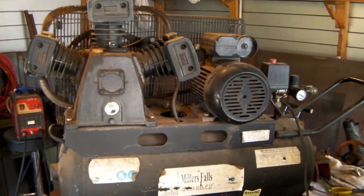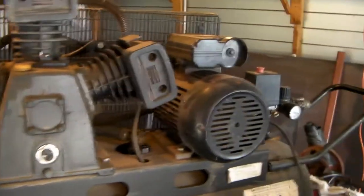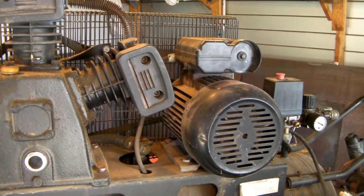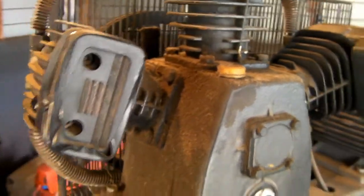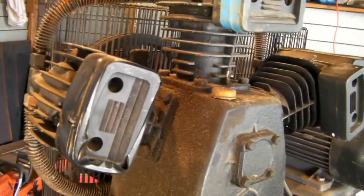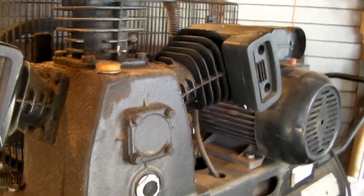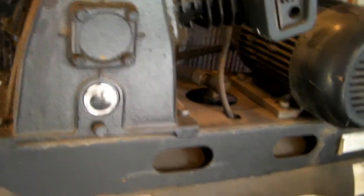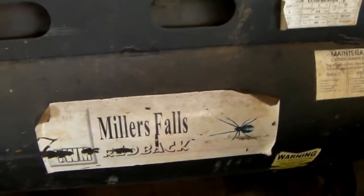This is the air compressor I use — it's an old 20-gallon air compressor. As you can see it's got three pumping heads on it, and it's the maximum you can run on single phase. It's got a three horsepower motor on it running into a 20-gallon storage tank, which gives you basically enough for most stuff you want to do in the workshop — plasma cutting if you turn the air consumption down a bit, spray painting, nail guns and other bits and pieces. The trouble is the tanks seem to rust out. This one is about five years old and it hasn't rusted out because I clean the water out of it.